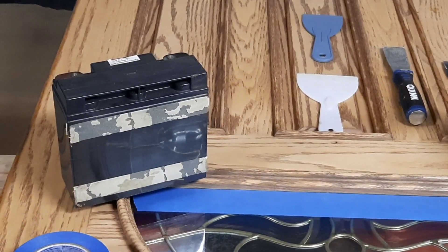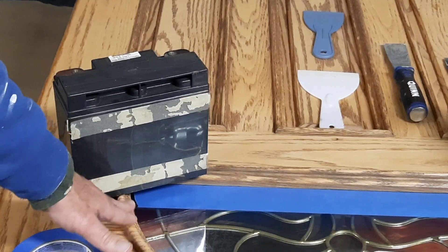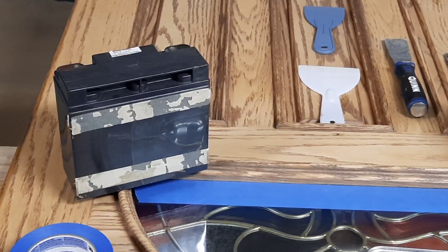Let's look at some of our equipment. We've got 120-grit sandpaper that we're going to be using on a random orbital sander, an ironing-board shape to allow us to get into some of those corners. On the molding it's a little more challenging to sand. Fortunately on the top portion there won't be much to do. We've got some 120-grit sponges and probably a little finer 150 and maybe 180 grit as well.